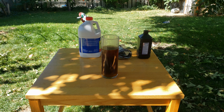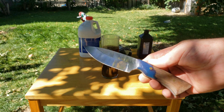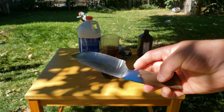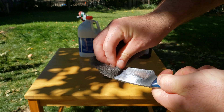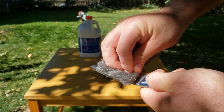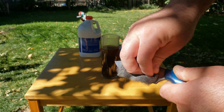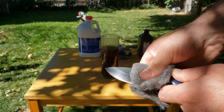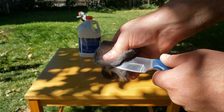Now that the peroxide has reacted, we are ready to use our ferric chloride to etch some steel. To demonstrate, I'm going to be etching this knife that I made a few weeks ago. Generally, it's not a very good idea to etch a fully finished knife — you should probably etch the knife right before you add the handle so you can etch the full length of the steel. But I didn't have any blanks laying around, so I'm just going to tape off the handle so the acid doesn't get to it, and then we can etch just the blade. Before we etch the blade, we're going to need to clean off the steel to make sure that there's no oils or anything that would keep the ferric chloride from reacting with it.